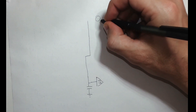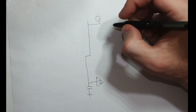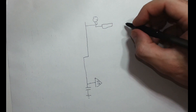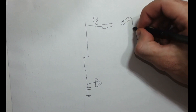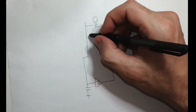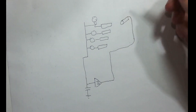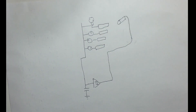Take that right leg and patch it into the rail, then the middle leg goes to a copper pad. You have a wand or stylus to make contact with that — I put a screw on the end of a stick, soldered a wire to it, and that wire goes back to complete the circuit for your Schmitt trigger. If you build a bunch of different potentiometer setups — I have eight — each one goes to its own pad. It's basically just a multi-switch; you select each one and change the pitch to your desired scale. And there you go, you have a stylophone.